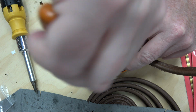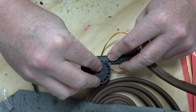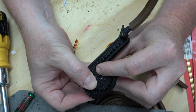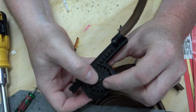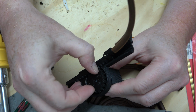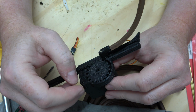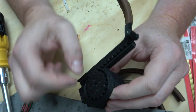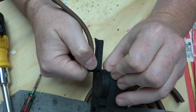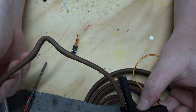Take the servo to its extremity and load the gear in that position. So yeah, counterclockwise. And then bring it back. Yeah, all right. Oh yeah, and there's a limiter here, so that's all the further it can go. Yeah, assuming that's enough throw, that should work.